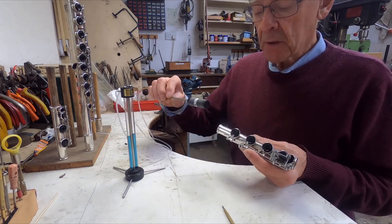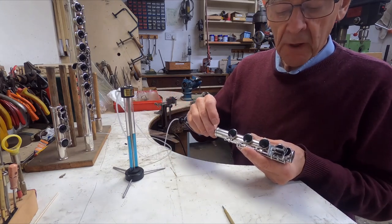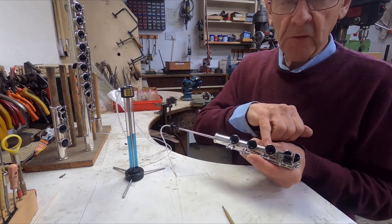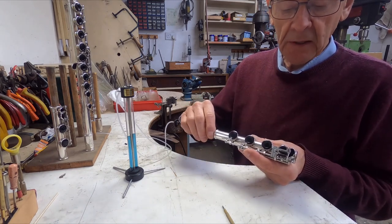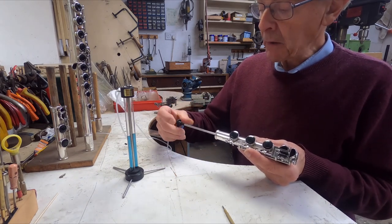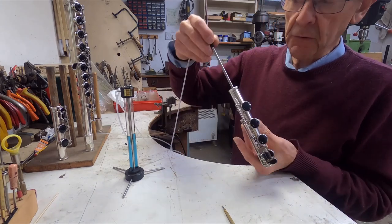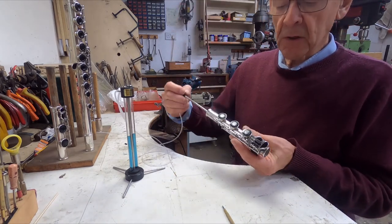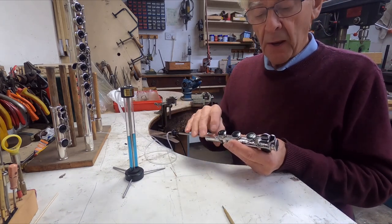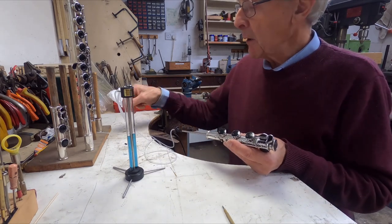Here's the ferret, and I'm going to put it down the tube until it's opposite that pad. The white band on the ferret probe must be just visible — it doesn't matter exactly where it is, as long as it's visible in the hole. Then turn the black knob up until it's fairly tight — not too tight — and that's locked in place. What that's done is created a little chamber underneath that pad.